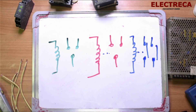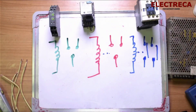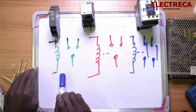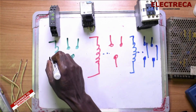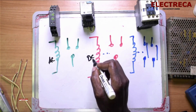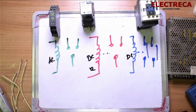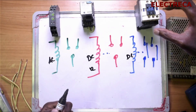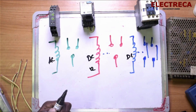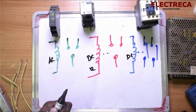These are the three devices we have here: a timer which is AC, a relay which is DC, and a contactor which is DC. The contactor is our main component that's going to run maybe our motor. The relay will be supplying the contactor, and the timer will be supplying the relay.